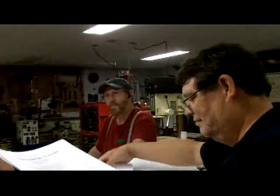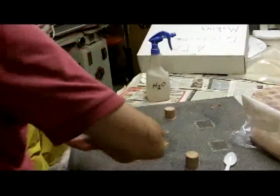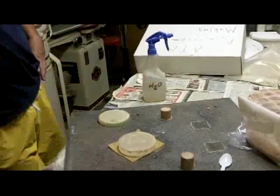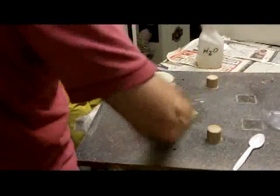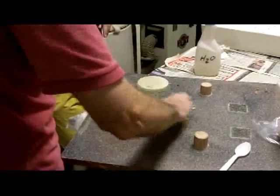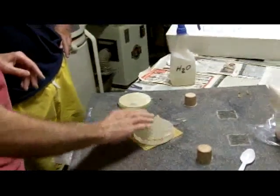You have both grinding and polishing. Right. But it's more of a gliding operation. It glides across and just. Right. You're more polishing the grooves instead of making new ones. Yeah. You're polishing it. So you're floating that actually. And so the powder isn't rolling, it's just gliding across, and it just glides the surface. And you wind up with a very polished surface.